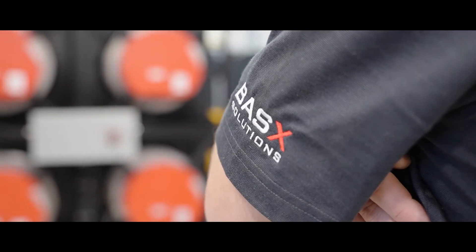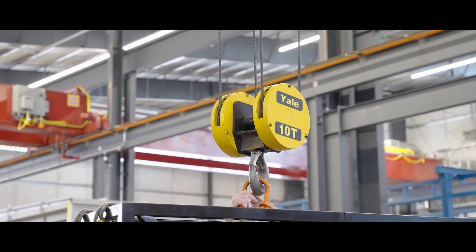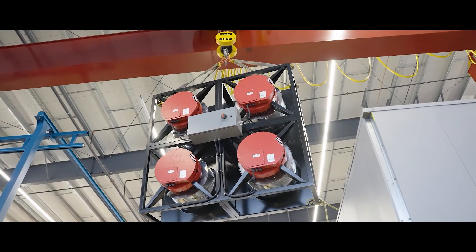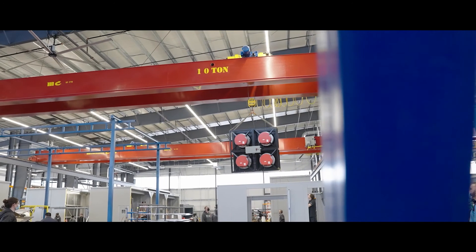Some of the challenges that we faced in the design of our equipment to house the IE motor was it's a new way of mounting a motor. You look at an induction motor — it's typically mounted as a foot or a C-face — and the IE motor offers C-face applications, but it also has a star mounting capability, and by doing a star mounting we can reduce steel and make it easier for our guys to build the equipment and get them into a unit.